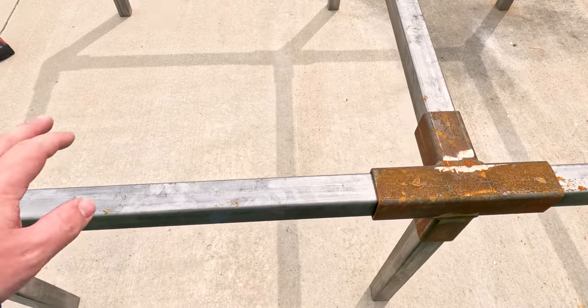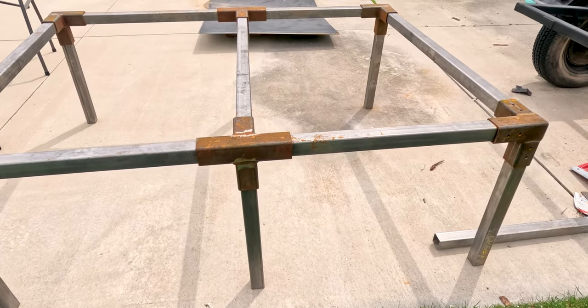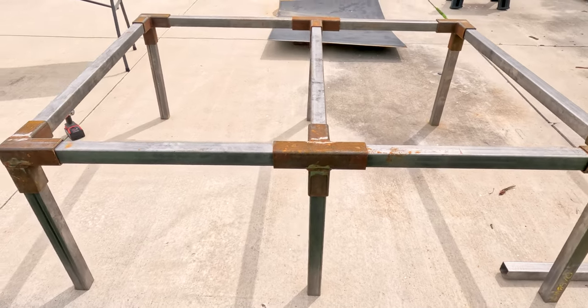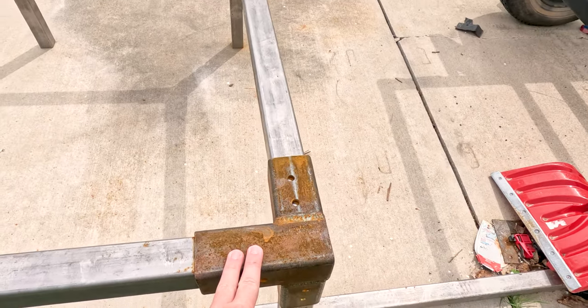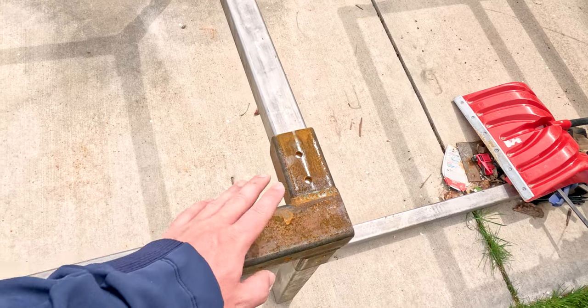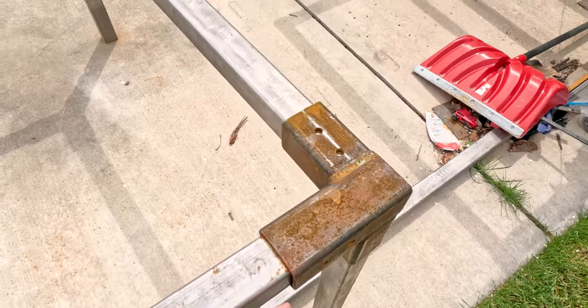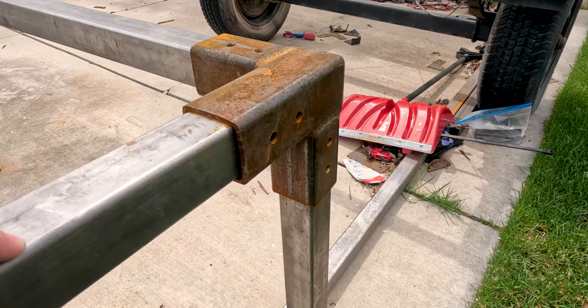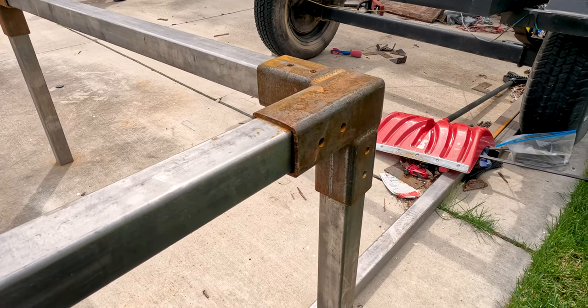When I ordered the frame I actually got each of these steel beams cut to size, so the really nice thing is I won't have to do too much trimming. However, I'm a couple inches over, so it does make it more manageable and I can lay it all out and see how it looks, but I still need to do a little bit of trimming so we'll work on that today. The main priority is to drill holes in these connectors. Each connector is two and a half by two and a half — two and a half wide, two and a half deep, by quarter inch. That leaves about a two inch gap on each side so the two inch piece of steel can slide directly in. The fitment is fairly decent, it does wiggle obviously, but I'm thinking with the bolts that'll all secure up. So for today's video we're going to drill a bunch of holes in these brackets, cut the frame out, make the actual structure of the trailer, and we might get it attached to the trailer today.